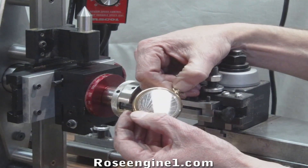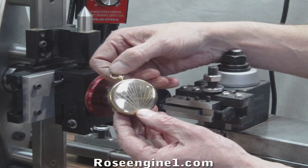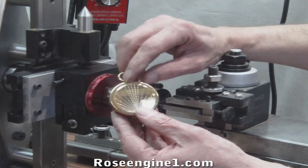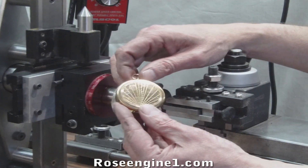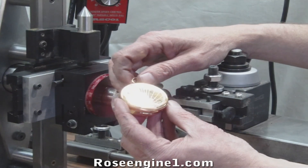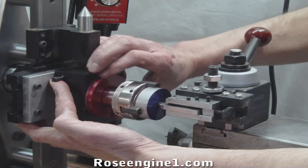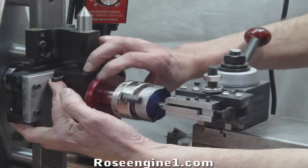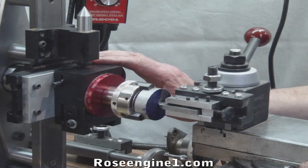You can see by the gauge over here — you don't have to go every two degrees, two and a half, or five. By going any number of degrees you want, you can have a preconceived idea of where you want the lines to break out. In this piece right here, my center was down here and I was turning the piece about every ten degrees until I got to the side, went back to the center, and did it to the opposite side. You can modify it by going ten degrees in the middle and twenty on the sides. The detent works really well on this straight line modification from Linda White.